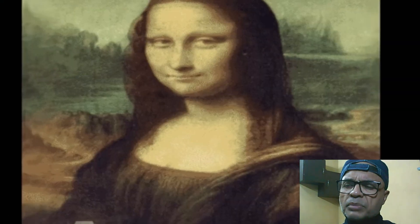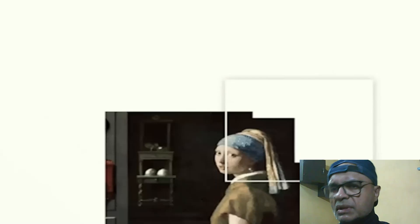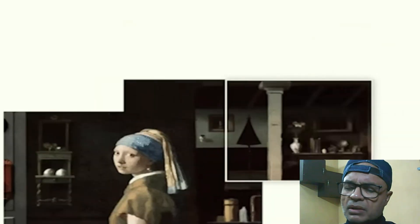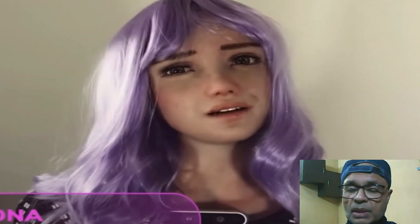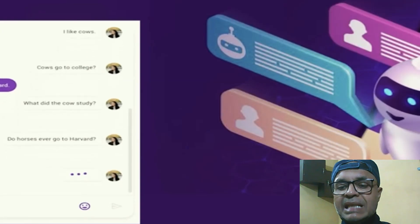In fact, if you want a small female humanoid robot — say around five feet — that is too small for hydraulic actuators. If you start with six or seven feet it's okay. That is a problem. One solution to counter the size issue is electro-hydraulic actuators, or EHA.